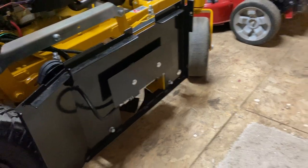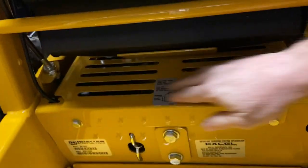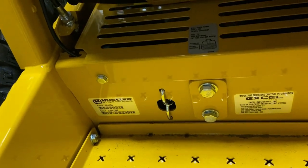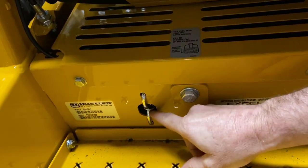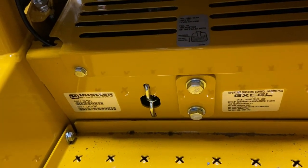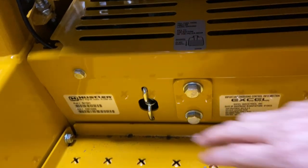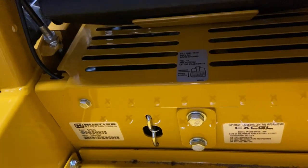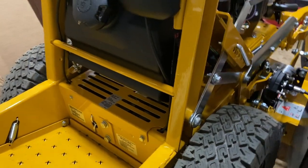The third thing I want to talk about is the spring for the hydro belt tensioner. If you're familiar with ICOT Grass LLC, he also has a Hustler Surfer Pro and within about three hours his spring broke. I also had a comment from another subscriber saying their spring broke after an hour. So I went ahead and ordered a spring from the dealer just to have on hand. For a ten-dollar spring, I don't want to be down for several days waiting for the dealer to get one in.